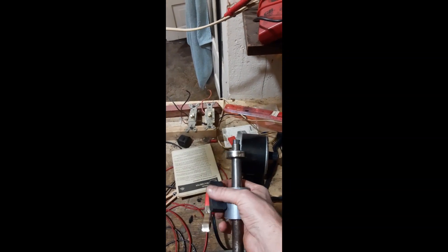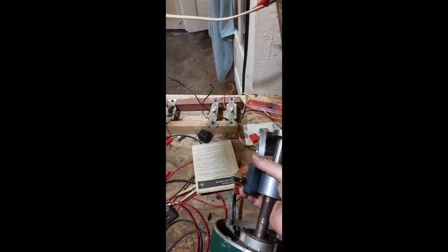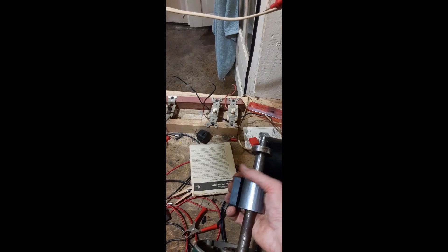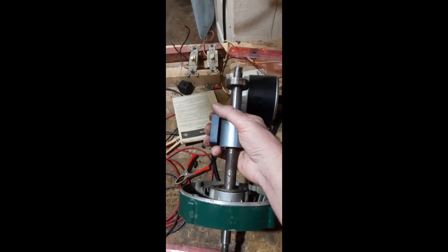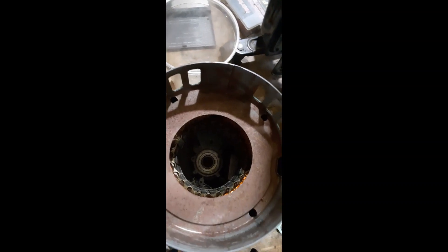When you do this, it's going to want to pull, it's going to want to shoot apart — the magnets are so strong that just having hot glue on there isn't enough. The first one of these I ever made, I used a shoelace. I got all the magnets on there and then I used a shoelace, but you've got to compensate for the distance — the thickness of the shoelace — and you don't have a lot of room here. That's all I could fit with six magnets in there, that's all it'll fit.